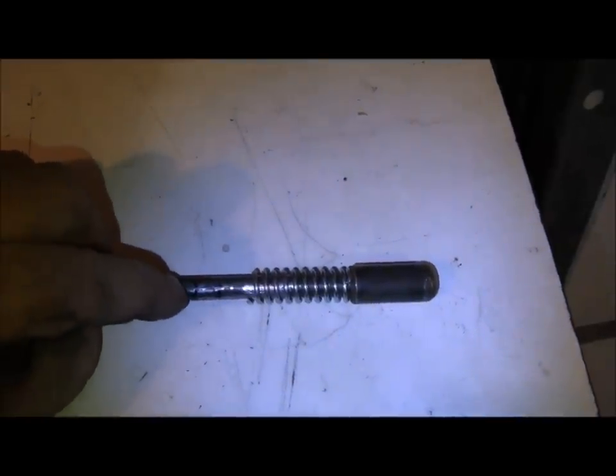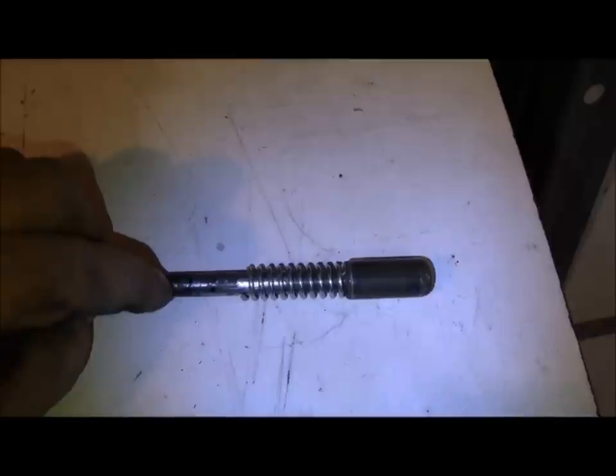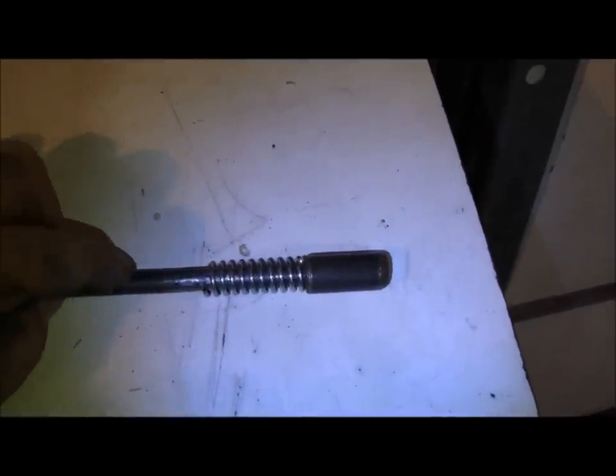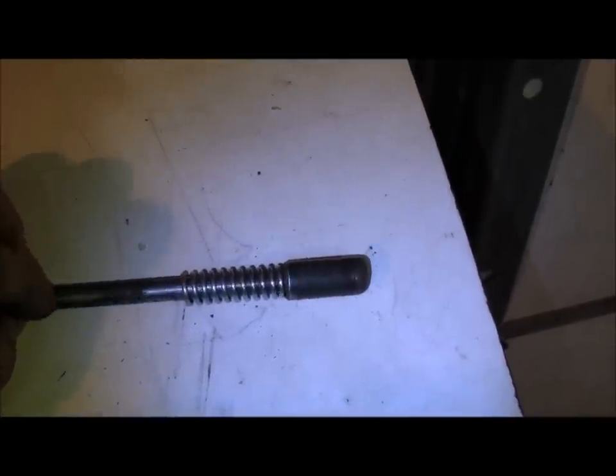I've got two marks indicating where I want to heat and bend it so that it has the L-shape handle that everybody's familiar with. The goal is that the leg is supported on the heavy end of the pin — you don't want the leg supported on the short end where it might bend or not hold firmly. I positioned it in the casting, saw where it just comes through on each side, and made marks. Now I'm going to do a little painting, grease it, put it in the casting, heat it at my marks, bend it into the L shape, and we'll have the plunger assembly back working.